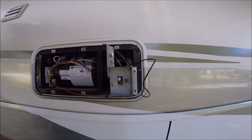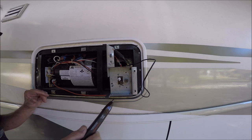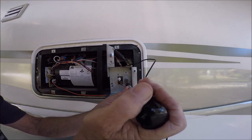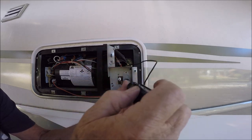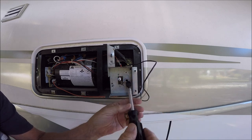The problem on my unit was this orifice was plugged up. This is a 7/16th orifice. I'm going to show you — take this out and you don't really need a new one, you can just clean it.